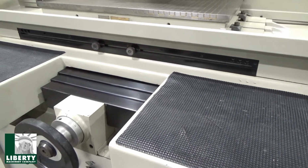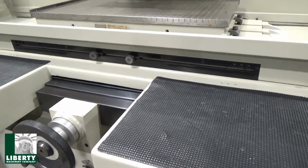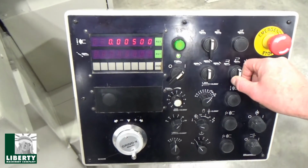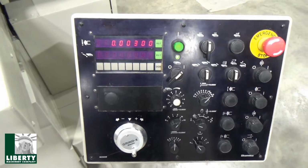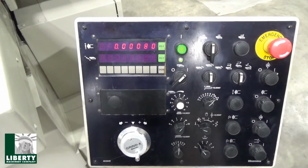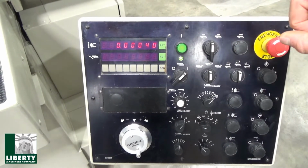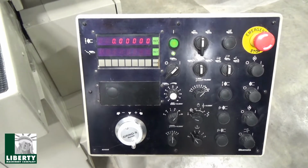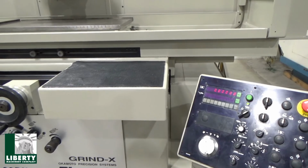But on the fly, I'm just going to switch over to spindle again and get off a traverse grind, do plunge grinding. I'm just going to flip over just to move it along here. Every hit, it's going to go down, and at 1,000th, it'll transition to 2/10. Right now, there's 8. Now 2/10 at a time, 6, 4, 2, and then one spark out after this. Table should go back forward twice. I mean, you can't see both, so, and it just parked.